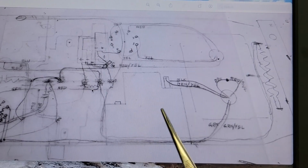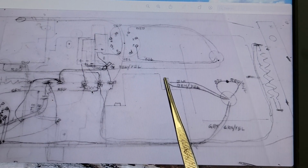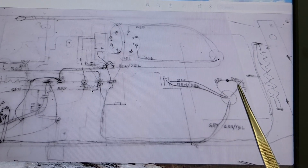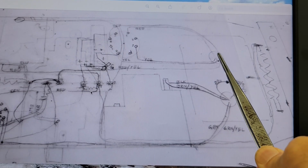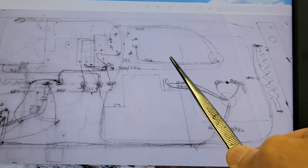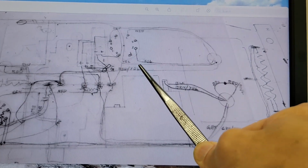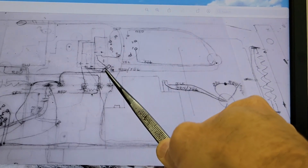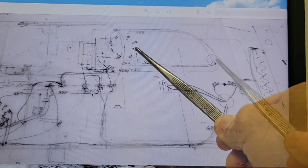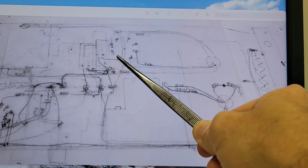diagram. Here's the power input module. So AC power is coming in here and coming out here, going to the transformer. Buck modification is here, and then we've got power coming out the secondary here. These yellow wires are the 5-volt supply for the rectifier tube, and the red wires are the AC power coming out at like 290 volts each relative to this red yellow wire, which goes to ground. That's the center tap of the secondary for the main power part of the transformer. So the yellow is the heater, but that's also the end of the diodes, if you will.